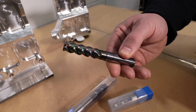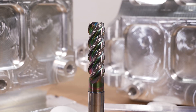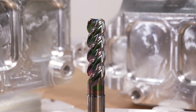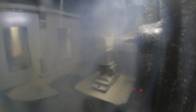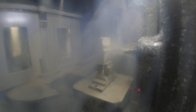What's really impressed me is the ability to remove material quickly, efficiently, and to offer a really stable solution that's very light. Combined with our CAM system, we are using newer techniques — adaptive tool paths — and ultimately that just reduces the likelihood that the tool is going to break. What's impressed me with the tool is the reliability of the process. We've machined 50 parts and the tool still looks brand new, still giving us great surface finish, still performing faultlessly.